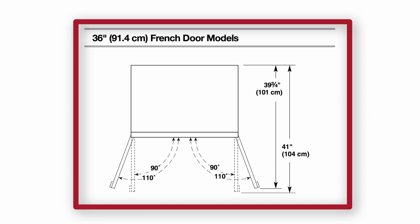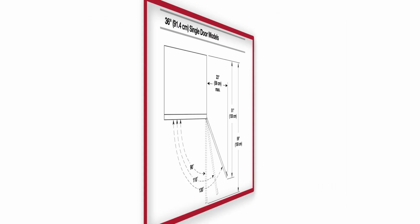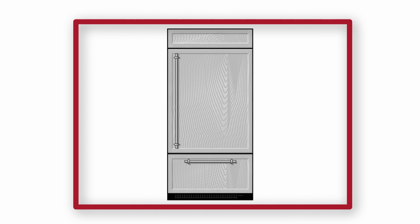The location must permit all doors and drawers to open freely and without obstruction according to the clearance measurements outlined in the installation guide. For corner wall conditions, an additional minimum clearance distance of 5 inches is required. More clearance may be required if you are installing custom overlay panels, custom handles, or extended handles.